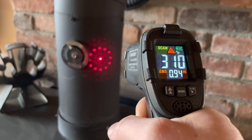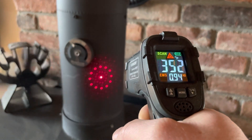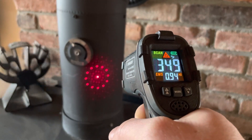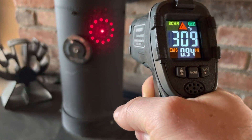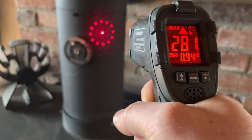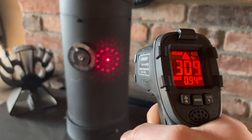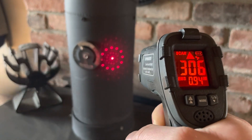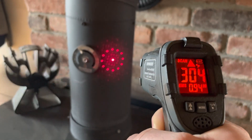Flues are temperamental. If you just go a few inches down, you can see that raises the temperature 40 degrees. And if you just go a few inches up, it'll bring the temperature down about 20 degrees. So it definitely matters where this thing is placed. If you're testing the accuracy of yours, you have to measure at the same exact height as the thermometer itself.